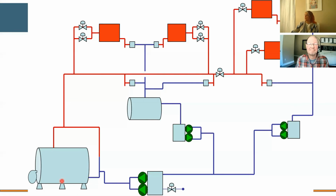We have clarification on the slope question. Do steam and condensate pipes require slope? If so, what slope should they be? That's a good question. Condensate lines, I want to tell you it's 1/4 inch per foot. Yeah, it needs to be graded. I can follow that up with a better response as far as the grading goes. But it does need to slope. You do need to pitch it so it naturally falls. I want to tell you it's 1/4 inch per foot, but I could be off on that. Thanks, Brian, for your input. One of our attendees responded to the slope question.